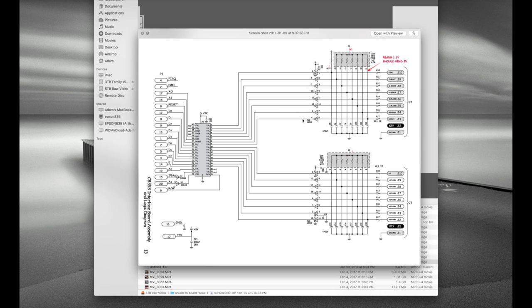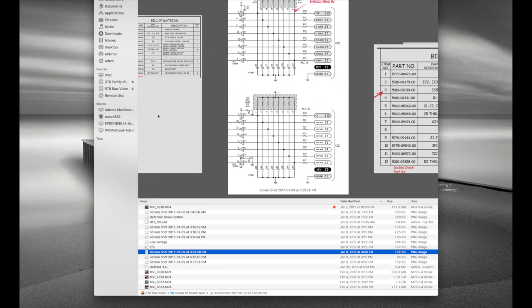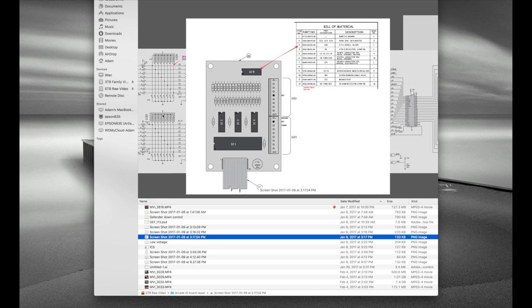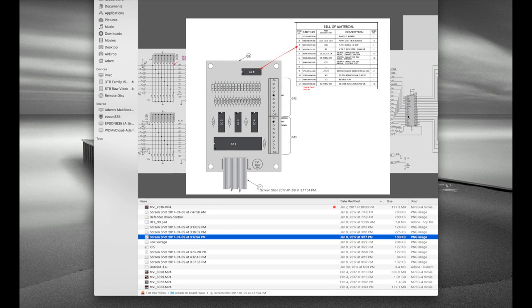None of these unused sections were used but they all work, so what I did was I cut the traces and made the 'down' signal go through one of those unused lines with some jumpers, then jumped back over to give this chip the correct signal. So if you have any questions let me know. It would have been way cheaper to just buy a new board, but it's great education — I didn't know any of this stuff. Thanks to Adam at OneCircuit — I'll put a link to his channel in the video description. I watched a lot of his videos between the start and end of this project. Lots more videos to come — I'll see you guys next time, thanks for watching.